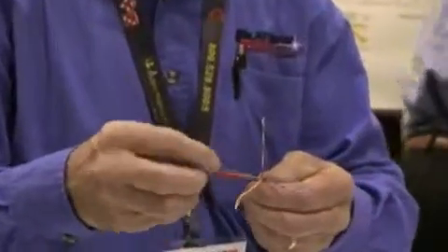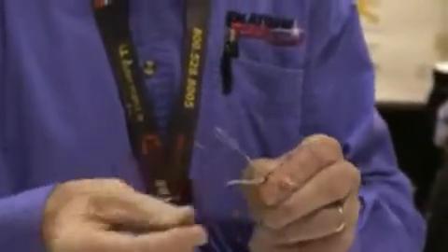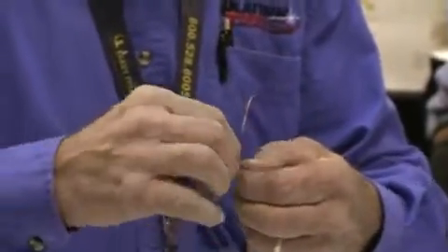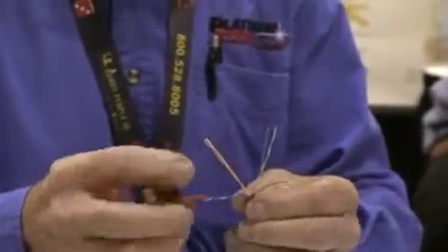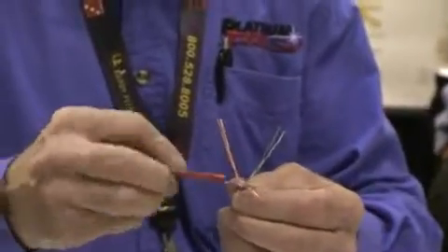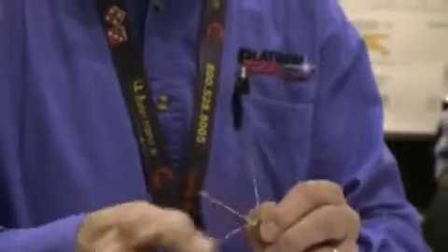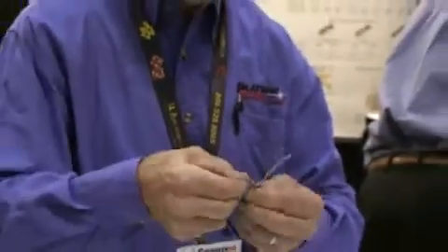Because you want to be able to lay the conductors side by side with no gaps. You come off, and of course you'll note each pair is twisted at a different rate — some untwist easier than others. But that's so there is no crosstalk.